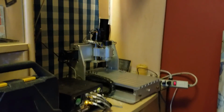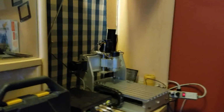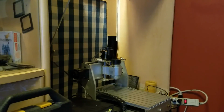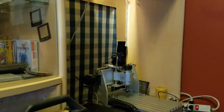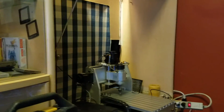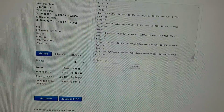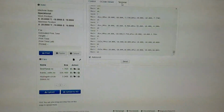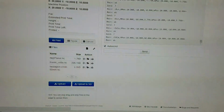And if we go here, we can hit this button. You might have been able to hear it, so we'll do another really bad pan. And you can see it moving. And the y-axis, and the x-axis, I'm sorry, y-axis, z-axis, we'll make it go down first, and up. And so this does have provisions for connections for your end-stops. You can do PWM for your spindle, you can shut your spindle on and off, you can hook up your e-stop, just about anything. It breaks out just about everything.